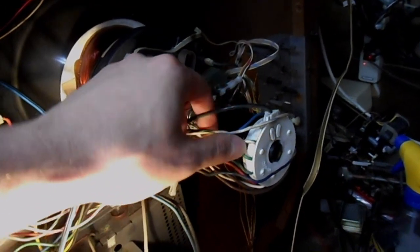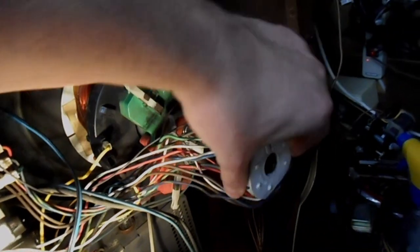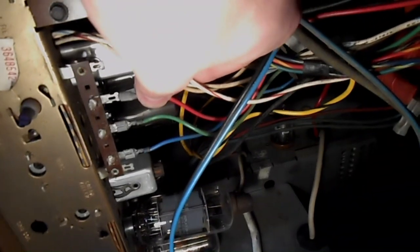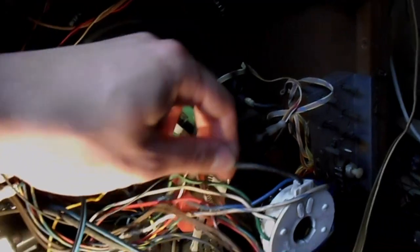The other thing you can tell at a glance above chassis is that it's a Z chassis is this white removable picture tube base connector. I'm pretty sure this is original to this set because it has the crimped on spade connectors that can be unplugged for the grids here and the cathodes here are unpluggable. They hardwired the G2 leads, the heater leads, and the focus wire.